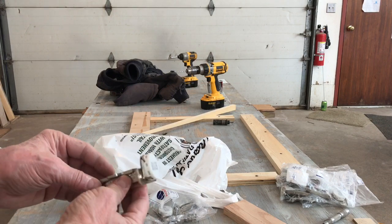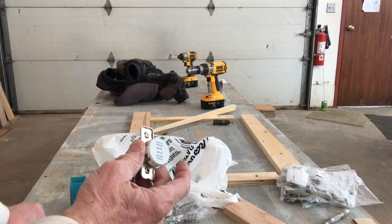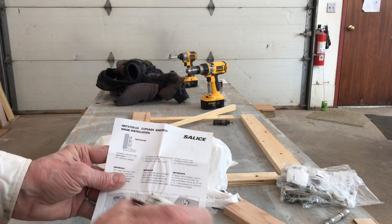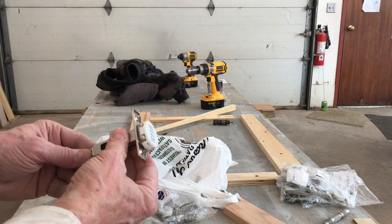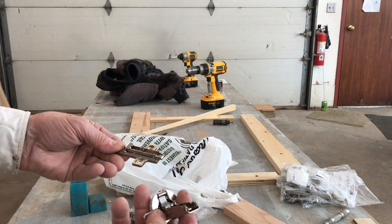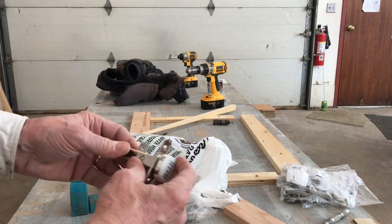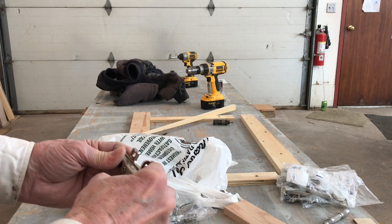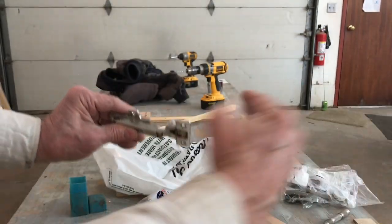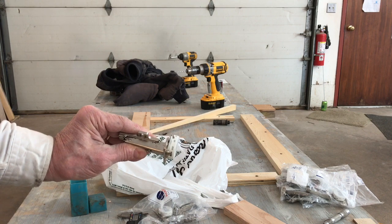There are a few things I'd like to show you about these hinges. The back side is always going to be 35 millimeters, drilled with this bit to a depth of about a half an inch. This particular hinge is called a full overlay hinge — it's going to set the entire face of the door covering the cabinet carcass. It has a quick disconnect right here: you can pull that lever and that part of the hinge comes loose, so the door is easily removable. This is also a soft-close hinge — it opens 105 degrees, and when you go to close the door, you push it part way and it'll finish closing itself, so the doors won't need any door catches.